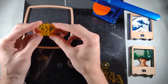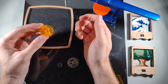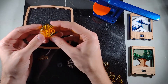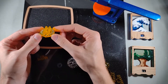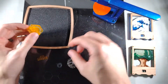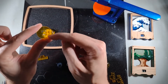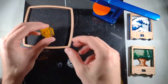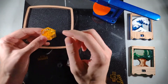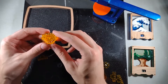This piece has a spin to it — it holds its place but you can easily move it to another location. So if I wanted this to say 10 instead of 13, I can just rotate it. This is a great way to have a counter with no glue involved. You saw how quickly it came together, and these pieces go all the way through with tolerance based on the length of the slot rather than the width. You'll need a little bit of trial and error, but adding that wedge corner really helps.